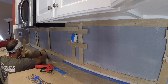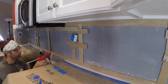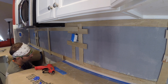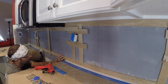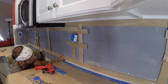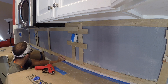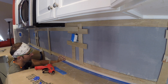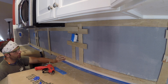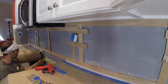The thing I like about doing it like this with the mosaic — especially if they're not square on the edges, they're round, they're kind of curved — it's hard to spread your mortar to that. So you're better off just spreading a good amount of thin set on the wall, on the substrate, in the area that you're going to do it, and then just set it. So you don't have to come back after that area starts getting over you, put on more mortar, and try to get in between those little tiles in the mosaic. This is always a better, cleaner, more efficient way.